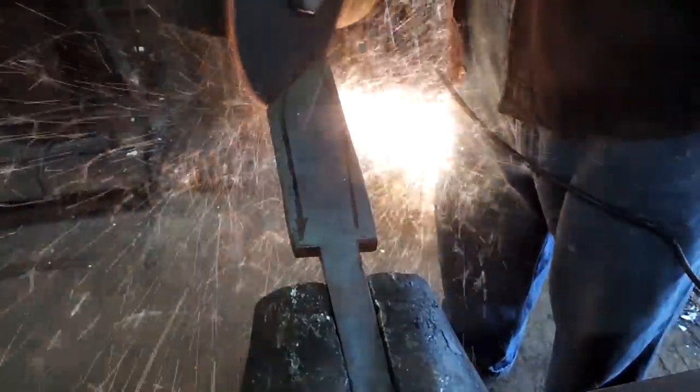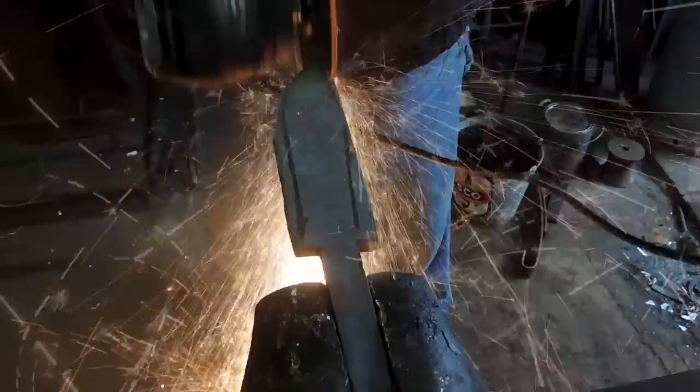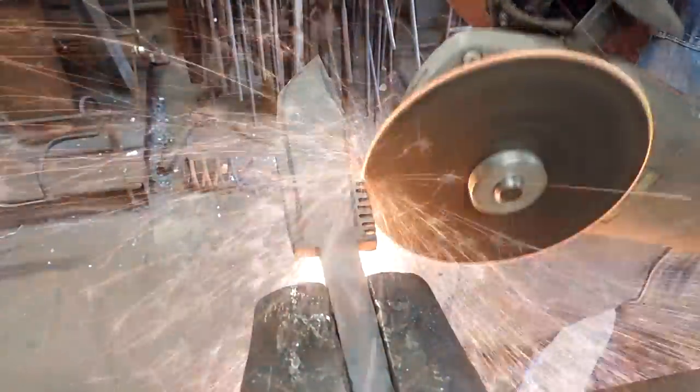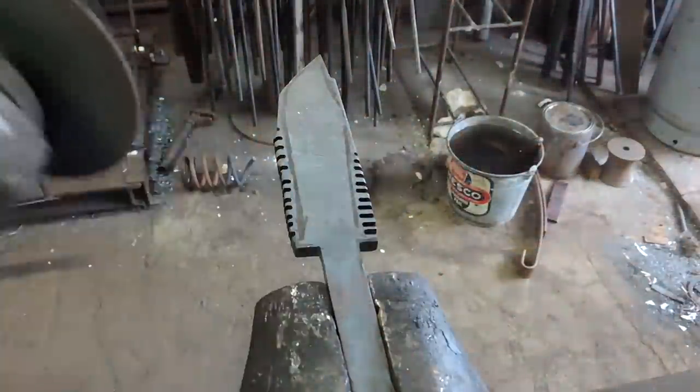So I keep thinking more and more that I've got to get my surface grinder built, and I had ordered in parts and pieces. I've been working on getting pieces and parts in for quite some time, and the one thing that I've been looking for is a contact wheel, because I want to use a 4-inch wide belt on it. They're like a 4x48 belt, and I can get them pretty easily, high quality belts. And the magnet that I've got, the switching type magnet that I've got for the thing, is 6 inches wide, so that'll cover a good portion of the center.